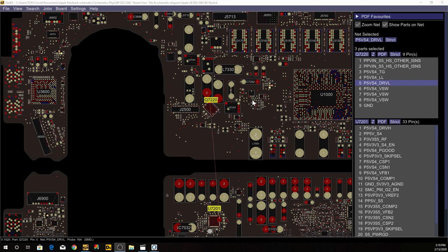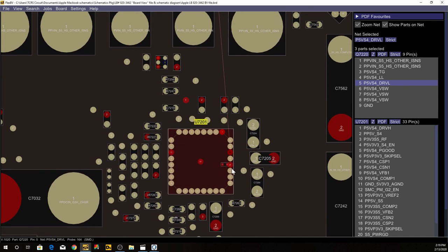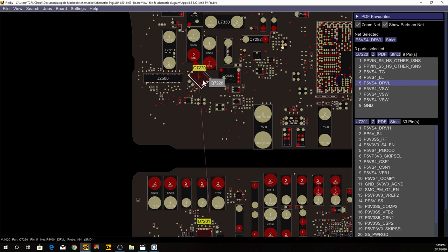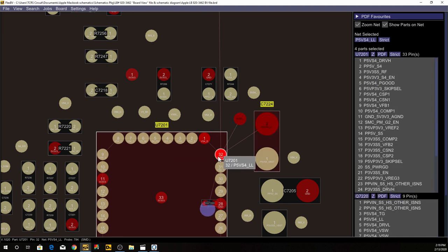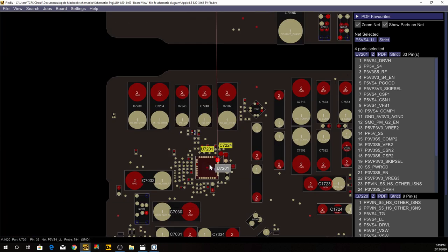Actually, let's look at this board view. Q7220 — this is the one that looks like it was soldered lousy. Remember this chip that had a little bit of corrosion on the leg? Well, guess what? This is probably our issue. I almost think this wasn't even soldered to begin with — I think it might have exploded from the little bit of corrosion. This didn't even look like liquid damage, just maybe a little condensation or something. PP5VS4 goes right to that FET. So we're going to get rid of this, and then we should get a working board.